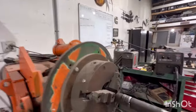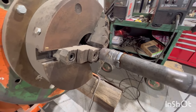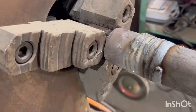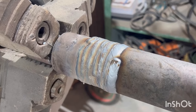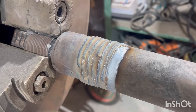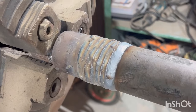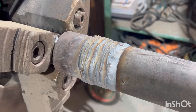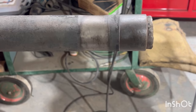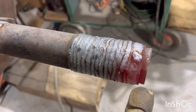Didn't turn out too bad. This was kind of strange this time - just building up this shaft I needed to go way faster than I ever have. Let me get you zoomed in here to take a look. Turned out all right though. I really wasn't trying to stack much on there because it's just going to need machined off. This is the difference - I usually weld pipe on here and I end up going a lot slower. I almost couldn't go near fast enough this time. Let me get out to the other end and do these other two spots. Okay, there it is. I tried to leave just a tiny touch of that shaft without burning it off on the outside edge to give me an idea where I'm going.